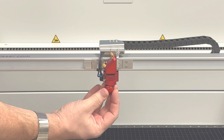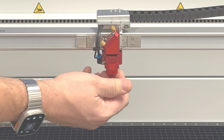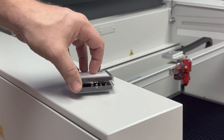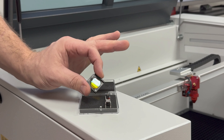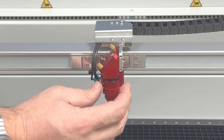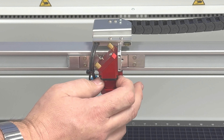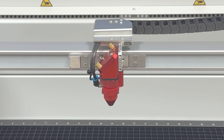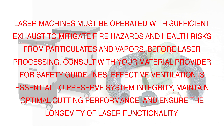Locate the collar, which will be red or gold depending on the system, and place it into the red focus head of the laser, screwing it into place. Next, locate the small hole nozzle or cone and screw it to the underside of the laser head until it is finger tight. Locate the lens and remove it from its case — this lens will vary based on what was ordered. Take care not to touch the lens and slide it into the focus head following the arrows on the lens for direction. Then adjust the collar until it is tight against the lens and tug at the lens to confirm it cannot be moved.